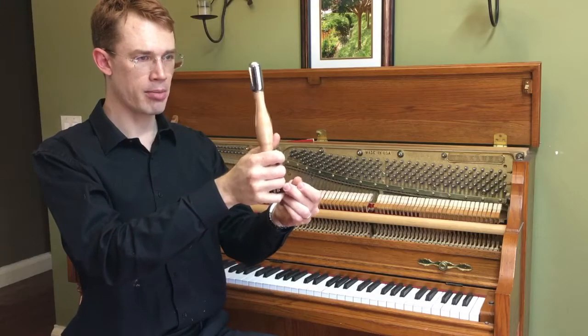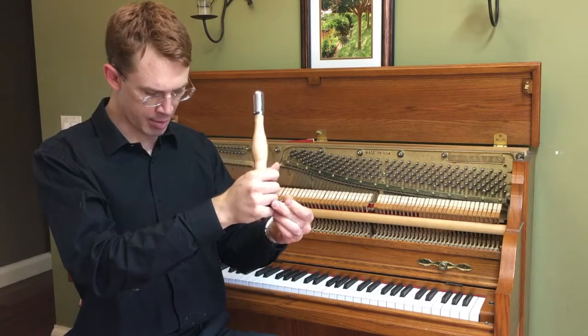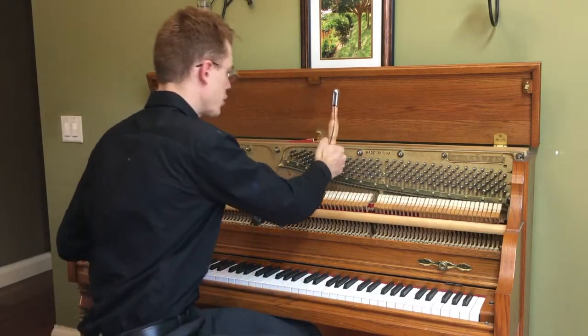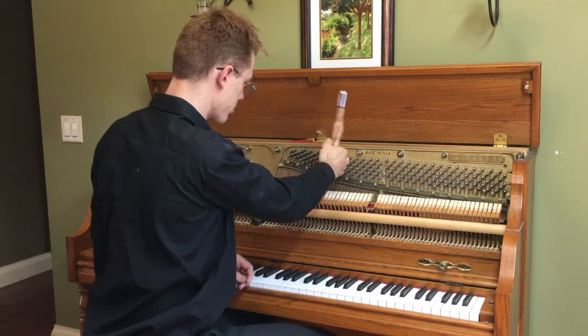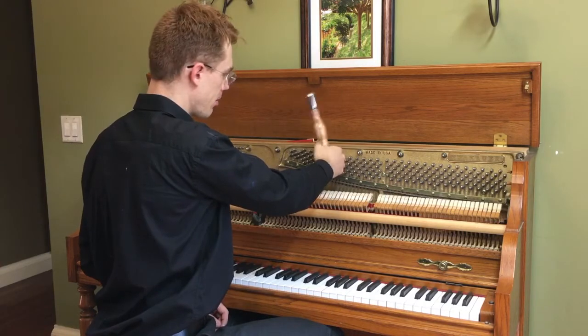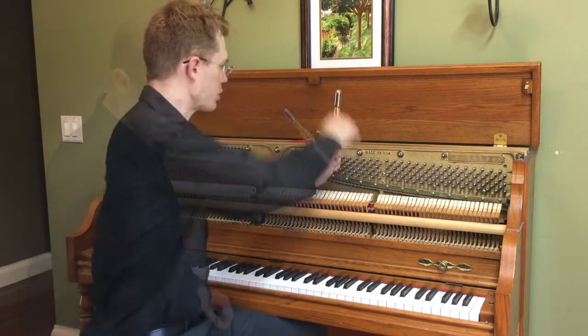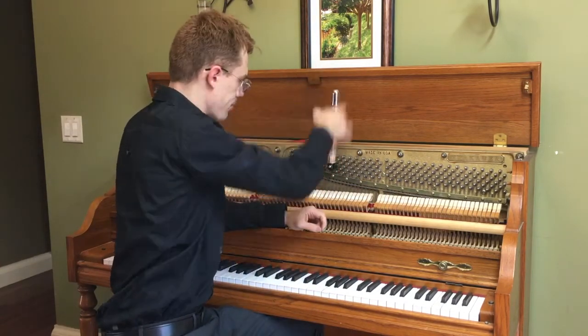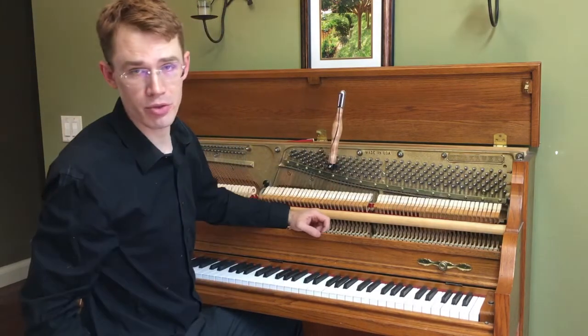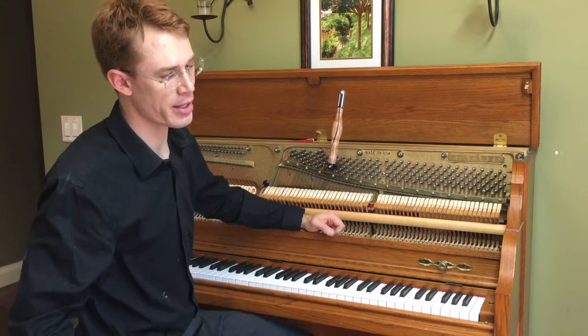So I'm using a swinging motion. I'm tossing that weight, I'm investing energy over time. I'm in my sphere of mechanical advantage here, and I'm just tossing the weight and moving the impact hammer, and that's moving the pin. So instead of coming up here to hold it, you're working directly on the pin. It's like you just grew about 8 inches. You're a lot taller.